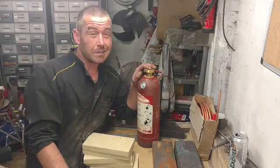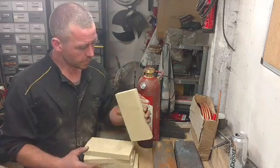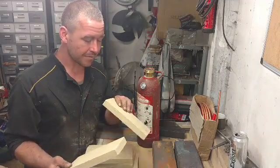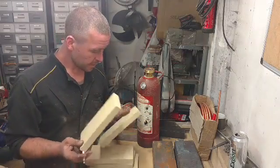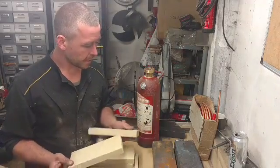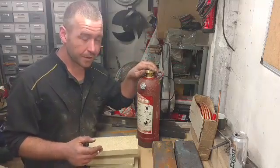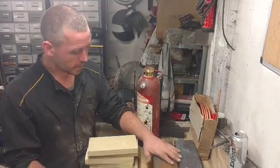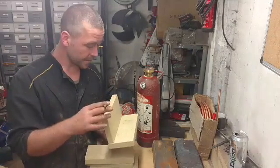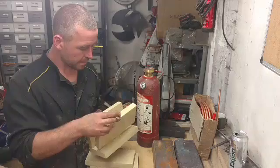Experimental micro waste oil forge. Got some old fire brick out of my stove — it's not actually old, it's brand new, but it was never installed because I put a boiler in the stove. So that stuff is good for 1200 degrees. It'll probably break up fairly quick, but either way it will be good for a test. Just going to go in a steel jacket — just to give you an idea of the size of the thing. A small little nice forge thingy.